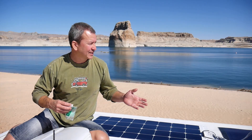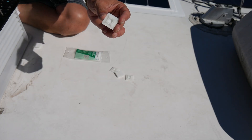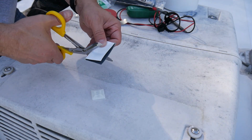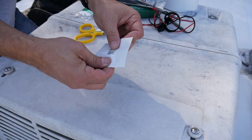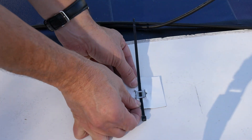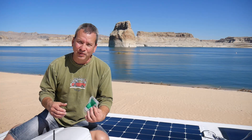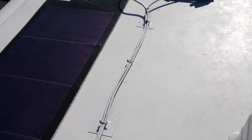I had some cables to run to hook it up to the other panels — about a 10-foot run. Instead of drilling holes again, I used these little adhesive mounting bases for wiring. I combined those with squares of Eternabond tape along the cable run, all the way back to where it ties into the rest of the solar panels. This approach worked pretty well — it's solid, and I can still remove the zip ties and add more wires or replace things if needed, so it's still accessible.